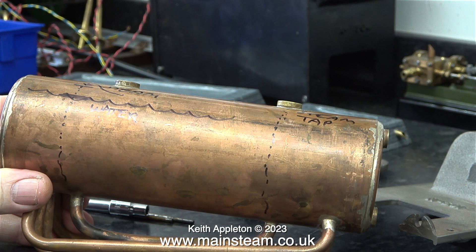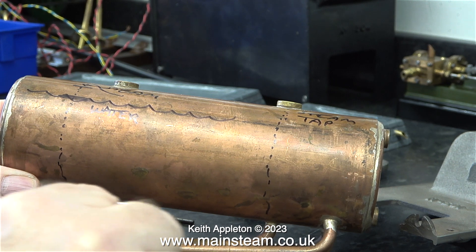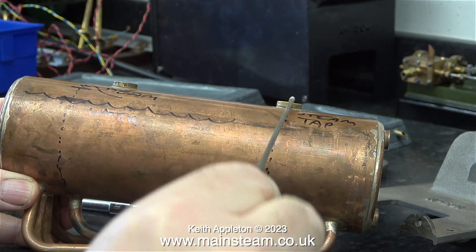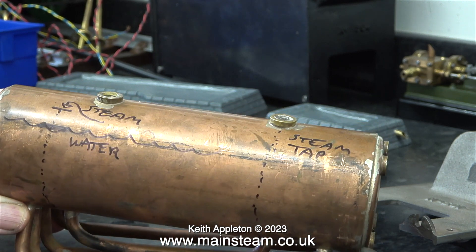I really do like the design of this boiler, and also the 504 boiler which is a good bit bigger. Just so there can be no confusion, I'm tracing the path of the steam from the inside of the boiler to the steam tap bush. You can't beat having hot dry steam for running steam engines, because if you run them on wet steam they don't run quite so well. This is not really a severe superheater - it's just a steam dryer.